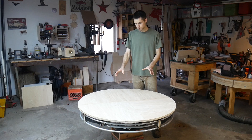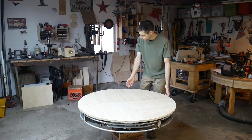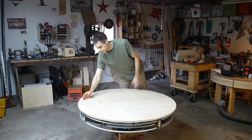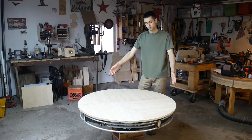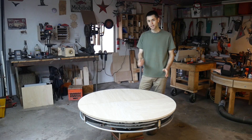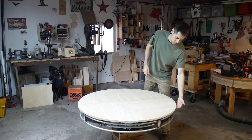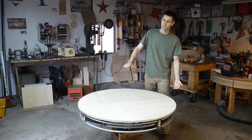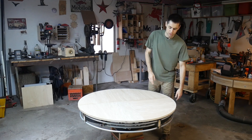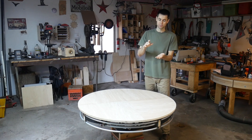Right now I'm focusing on this basic design — same as the other table — where you have a circle at the beginning and the skirt is underneath. The other option is to have a skirt which comes up on the outside so that it's faceted when it's small, meaning the radius is larger than it should be. To make it circular when it's small, the skirt has to come up around the outside. To do that, the top part of the skirt has to come straight up and down while the bottom part has to rotate, so you need a two-piece skirt. The skirt also starts on the bottom of the main panels and goes below to let the raising ones come out and up, which makes things more complex and requires more room for the ramps.